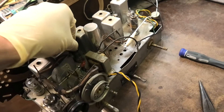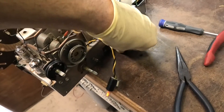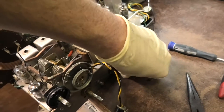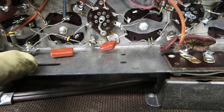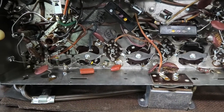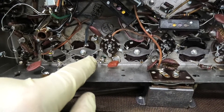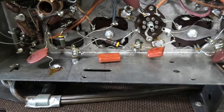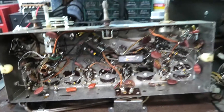It's actually kind of fun this way — what fun is just a recap? Of course it was my fault. I had moved this resistor out of the way to change this cap, and it was touching right here onto the IF, shunting the IF off through the antenna via this little doorknob capacitor isolator that comes through the chassis. Simple.